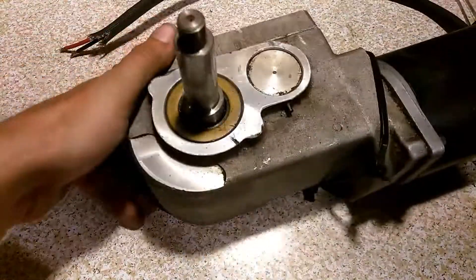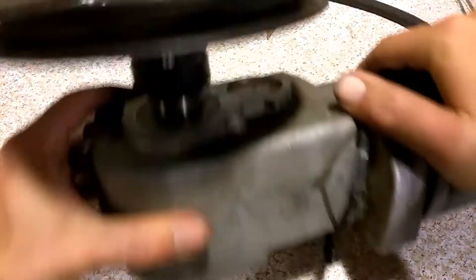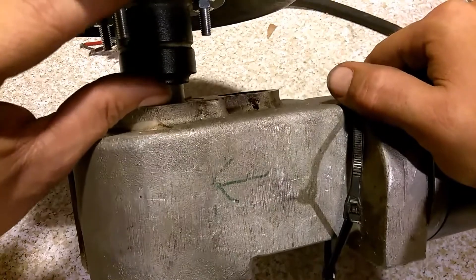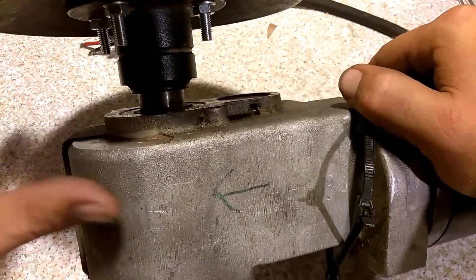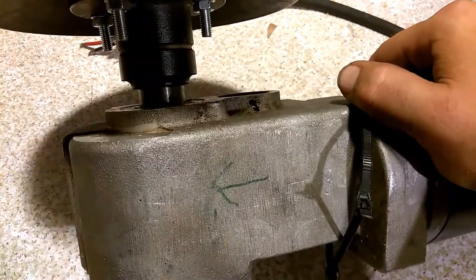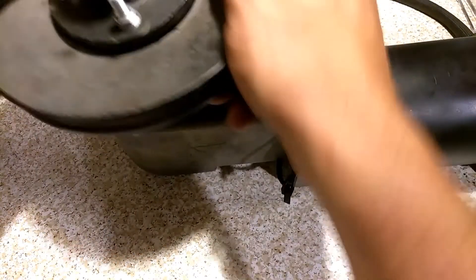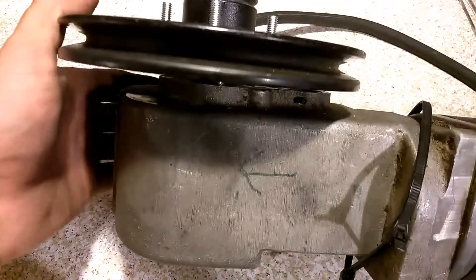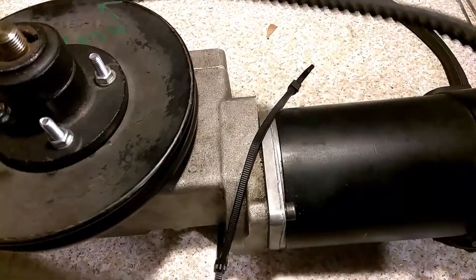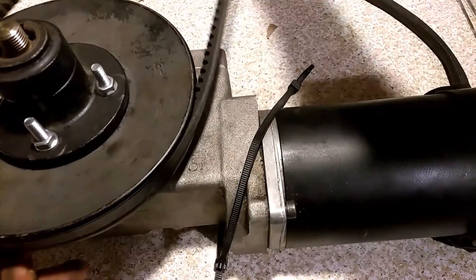This is going to give me two options. I'm going to lay this motor back down here. The hub here sits pretty far up on the edge of the gearbox, which — if you're using a bicycle — you don't want this to be all the way out here, because you want to get this weight closer to the center of gravity if possible. So what we'll do is we'll flip it over and bolt it in like this, and it'll give us the perfect amount of room and clearance for the motor, so when we have the drive belt on it, it'll go perfectly across the motor or anywhere we need to go.